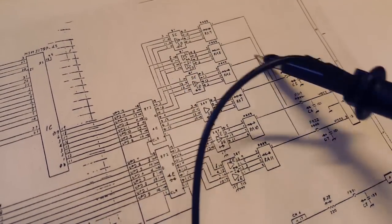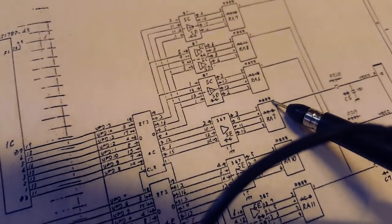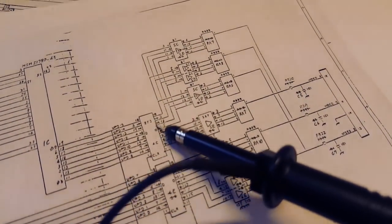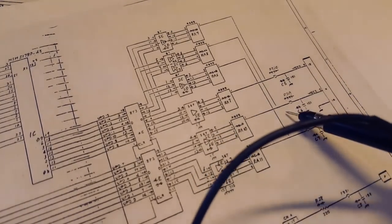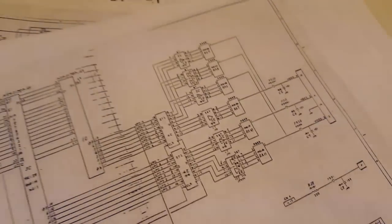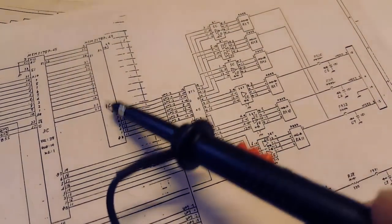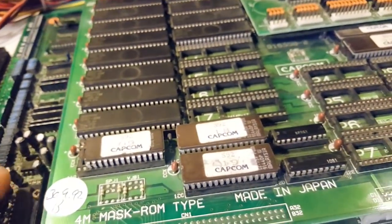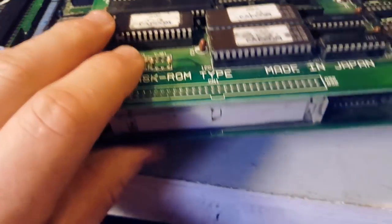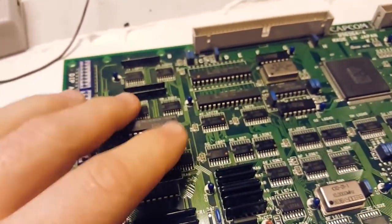The other RAM handles the green and blue signals which seem fine, so I wouldn't be surprised if this RAM is wrong. If not, it's probably one of those three things - could be the resistor arrays, but we'd expect to get some red from those. I think they're both buffers - an LS07 and an LS367. It could be this RAM causing the issue. I'm gonna start probing the RAM and see what we get, checking which chip is which on the PCB first.